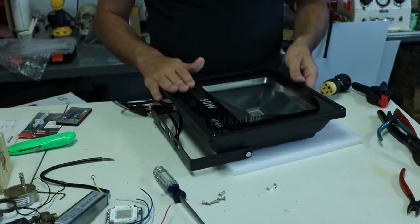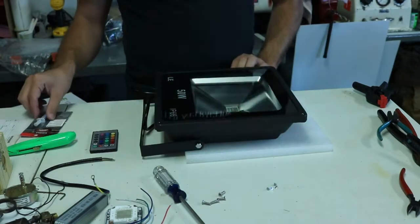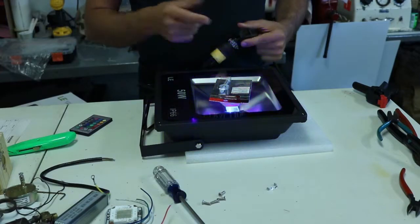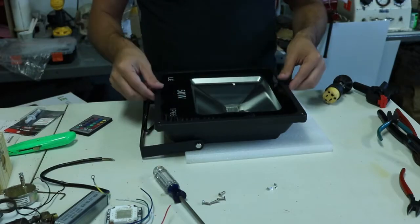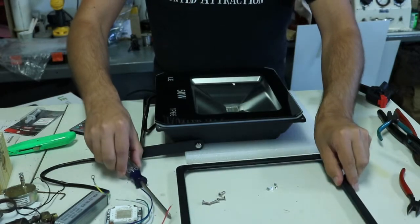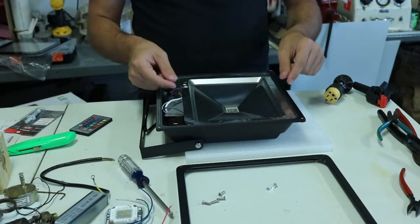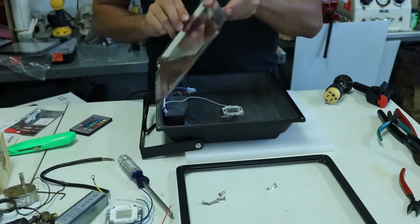So as I said, this is our floodlight — a 50-watt floodlight, RGB. I'm just going to block that because it's really bright, but this is all it does. I tried changing the batteries in the remote and tried different outlets to make sure there wasn't a problem with the cord. So what we're going to do is open this up. There are four screws on your outer housing, and this is generally the same going all the way down to the 10-watt floodlights as well. Then this glass comes off and it's got a little seal on it, so make sure you keep that where it won't get lost. Then we've got four more tiny screws holding this little reflector shield on, so we're going to pull that back.